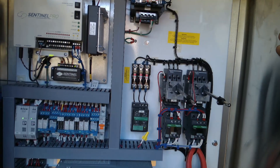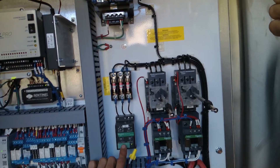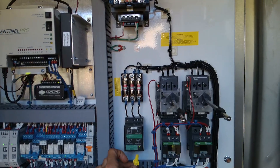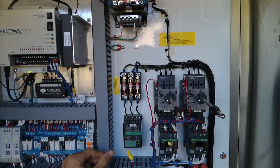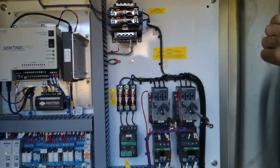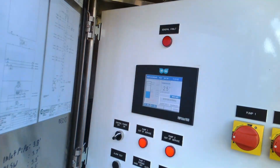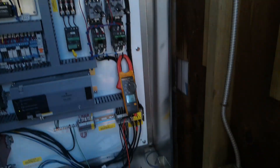So something's happened to the rotation — that's not good. At some point recently, nothing would work because our power monitor was tripped. Rather than notice that it was the rotation, someone just shunted out the power monitor. So now the rotation has changed from normal, meaning the pumps are spinning backwards. Single-stage sewage pumps like this will work backwards, but not very efficiently.